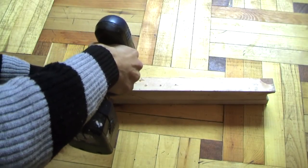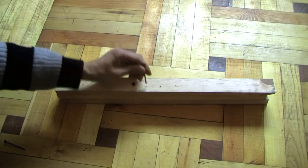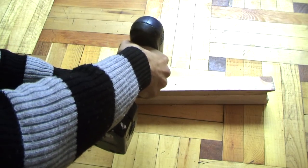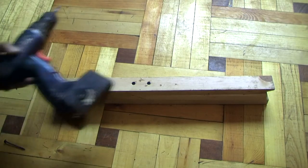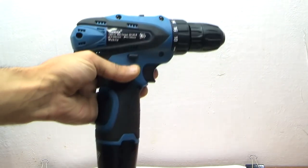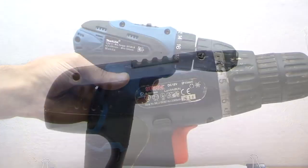But if you own a very cheap device and want to convert it to lithium, then it's not worth it. Even if all the components for the remaking are new, even from China, the cost will be considerable. Taking into account high current batteries, the conversion of an 18-volt screwdriver will cost a minimum of $30 to $40. It's close to the cost of a new screwdriver with lithium batteries, so I advise remaking only expensive instruments.